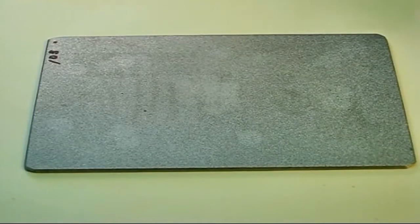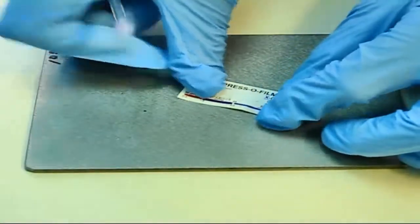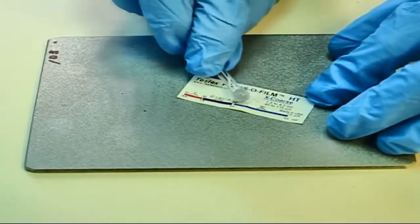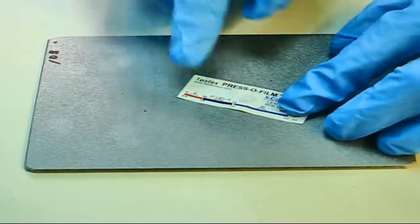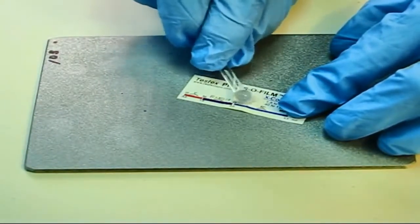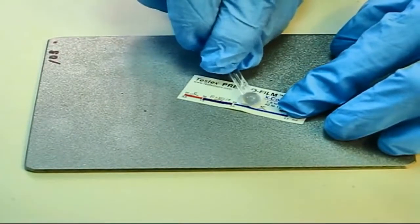Apply the tape to the blasted surface. Press the adhesive-backed paper to hold it securely in place. Firmly compress the replica tape with the smoothest surface on the rounded end rubbing tool provided, applying sufficient pressure to produce a replica with a uniform pebble grain appearance. Use either a circular or XY rubbing motion.